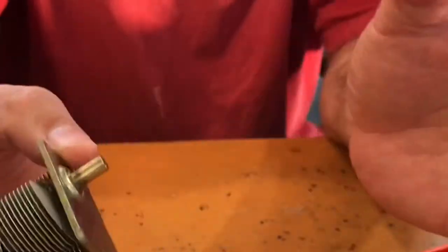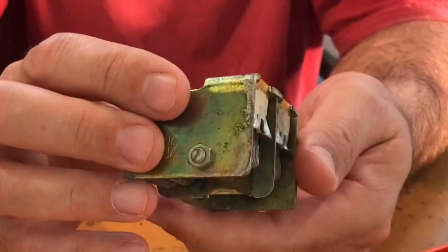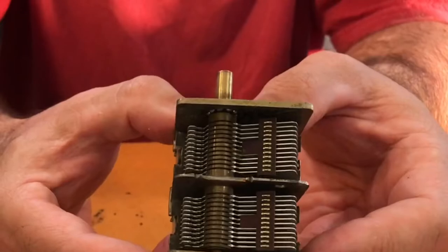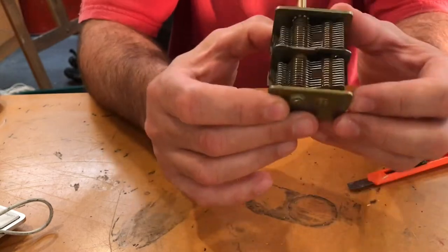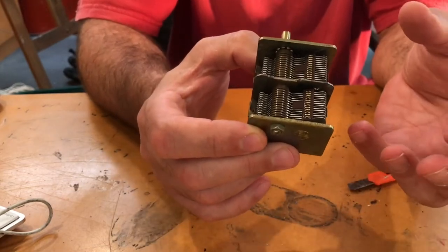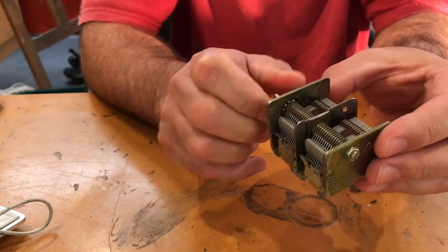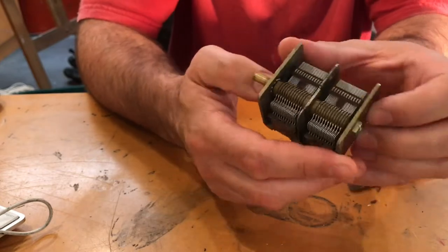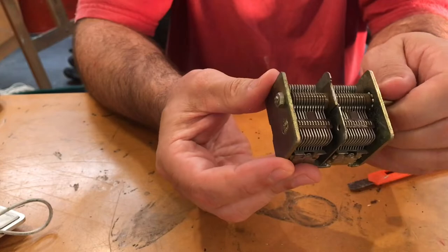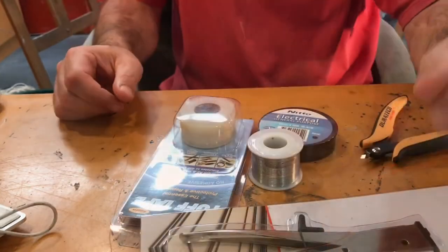QRP isn't a guarantee against RFI but it certainly reduces the chances of problems. You can also put low-pass filters and other filters in the transmission line to help. I'm looking forward to making this capacitor part of a small antenna matching unit. I plan to hand-wind a coil with taps, and this variable capacitor is going to form part of the L-match antenna tuner I'll be building. I paid about 30 dollars for it and I'm really happy to have a good old-fashioned variable capacitor getting a new life.